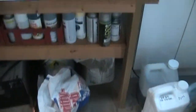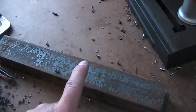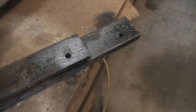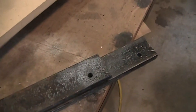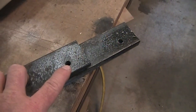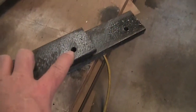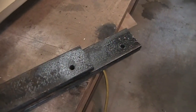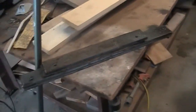I'm going to do a separate review video on the Milwaukee saw, but I love it so far. We're also going to drill holes for anchor bolts in some of these longer pieces — I've actually done this on some of them already. These are the bottom plates that go on the columns; you'll see it all come together later. I've drilled a pilot hole slightly smaller than the final size. The final hole will be nine-sixteenths, which will allow a half-inch anchor bolt — that should give us enough tolerance to get it over the anchor bolts.